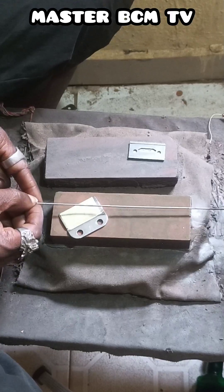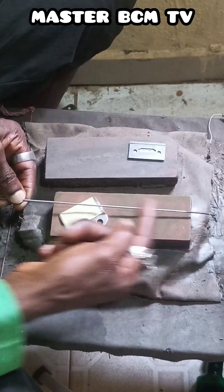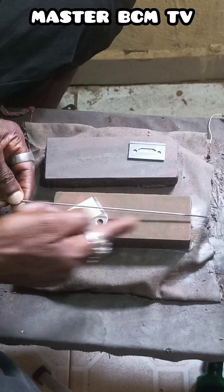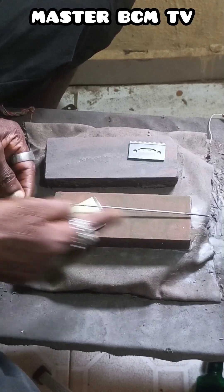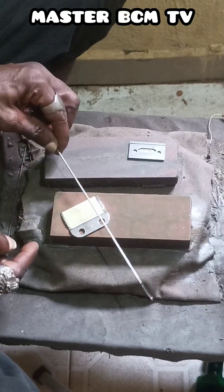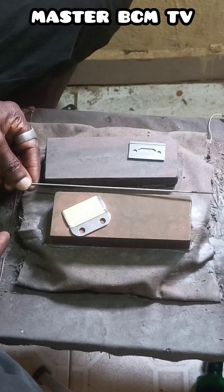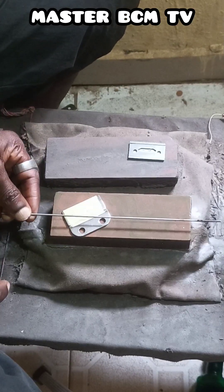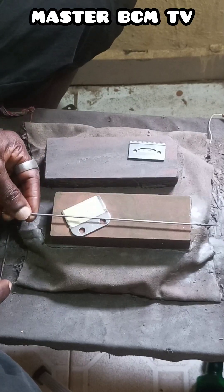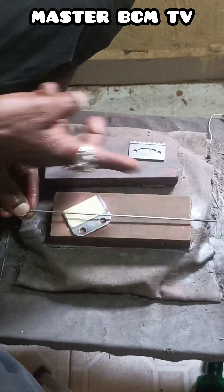This is number one, this is two — I'll use this portion, two-thirds of the top of the super hard manual sharpening stone, to sharpen the first side. My movement will start from here with a six arc movement — that is a six-arc movement in sharpening clipper blades — and stop here. When I want to sharpen the other side, I divide the stone into three again and start from one, use two, and sharpen this side with this side.